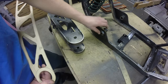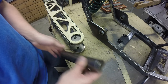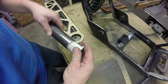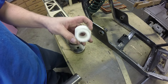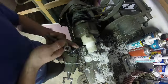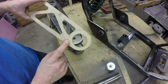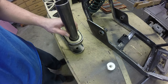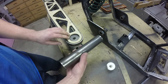Now that I've got the bushings put in at three quarter, I need to match up my swing arm to that same size. What I've done is I've cut a piece of tubing about eight inches long that's going to fit in between the two bushings. Then I'm going to make some plastic bushings to go into the tubing with a three quarter inch hole that I can run my rod through. I just turned these on the lathe - these are actually old parts of a coolant flush machine that was being thrown out, so I always keep this kind of hard white plastic. I'll weld the pipe in and I'll slap it together and show you exactly how it's all going to go together.